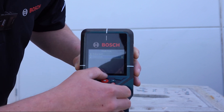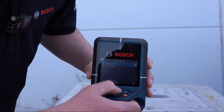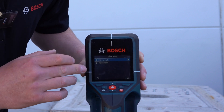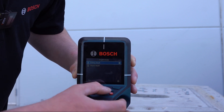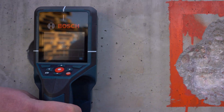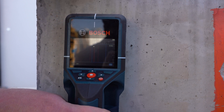So if you're drilling into concrete, we have a mode for that. What it does is tell you how far to drill and how far not to drill. Going up against rebar or post-tension cable, this view is often used. As you start scanning, it will actually measure the distance between your scanned objects, and as it passes over the object it's going to tell you exactly how deep it is.